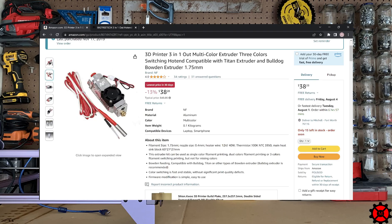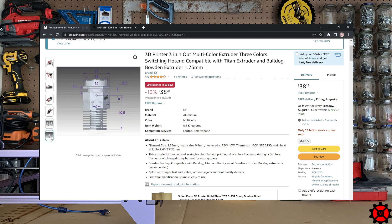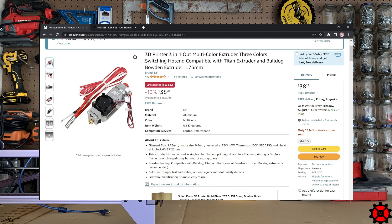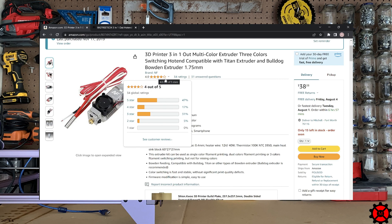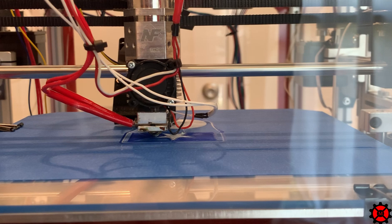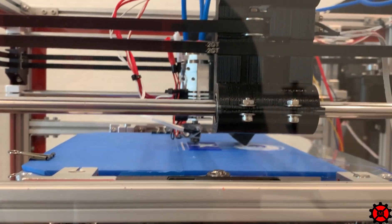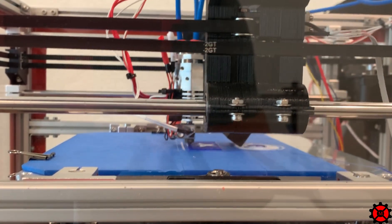One extruder called the NF 3-in-1 that I bought back in 2019 — I built an entire custom printer called InPrintX on it. It was so reliable I didn't have an issue with it for years. The small design was so good and fit perfectly for tight X carriages, and the all-metal design provided reliable parts. It's about $45 but includes all the heating components. I didn't like the flimsy thermistor wire attached to the hot end by a single screw, and the cooling fan was not a standard 30mm size which can cause issues. Yes, that's foreshadowing.